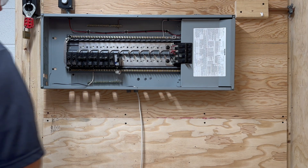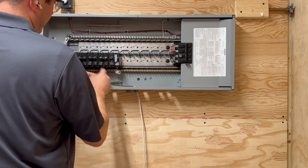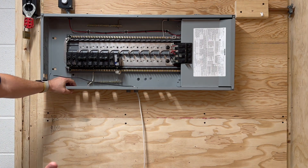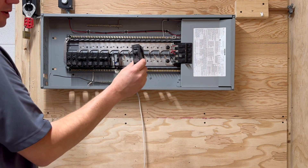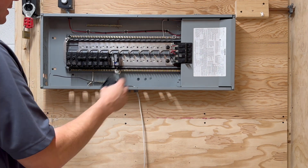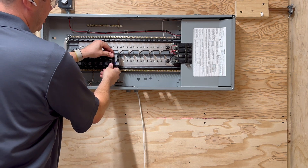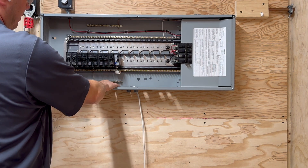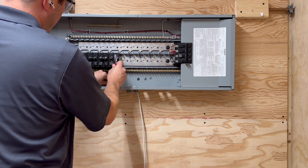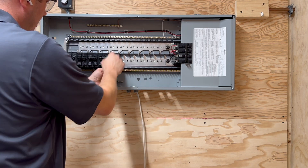The last wire we have to put in is the hot wire — the black wire — and for that one we have to find the right breaker. The breaker we're using in the first lab here is a single pole 15 amp breaker. They won't necessarily be in the same order as in this panel; this is just an example. You basically do this the same way you did the white wire: make a nice little small loop and go up nice and straight into the bottom of the breaker.